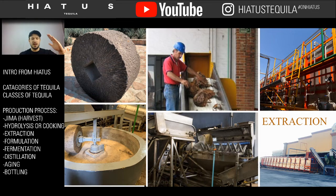So you shred the agave, you wash out all the juice, and at the very end, you kind of wring it dry, almost like a sponge. So it kind of gives you the best of both worlds. It gives you the press of the tahona, it gives you the shred and efficiency of a mill, but at the same time, you use less water. So you tend to have a more flavorful tequila.